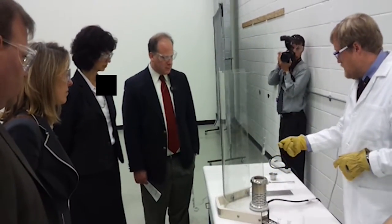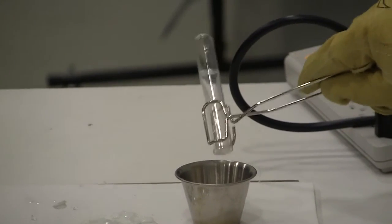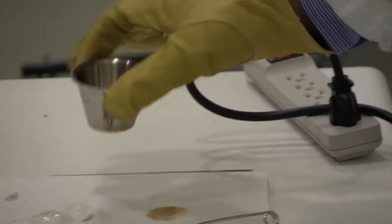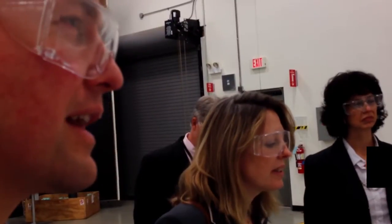It just makes a nice little clear liquid. I'll pour this out into a little stainless steel crucible — you could hear that little snap there, which was just a little bit of moisture at the bottom of the stainless steel. At 450°C this thing is a solid, so it doesn't take very long for it to form a solid again. Isn't that a nice feature? If you had a little crack and it was starting to weep, it forms a plug. Self-plugging.